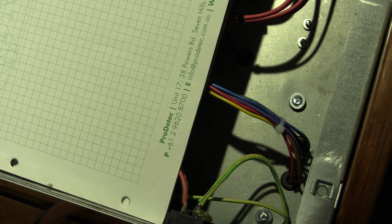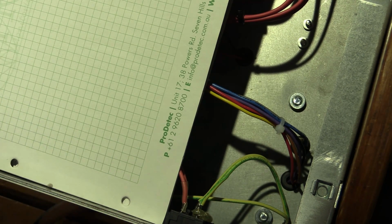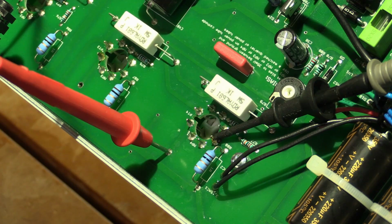And how do I know if I've reached the right voltage? Well, because plate voltages vary from amp to amp. But there's one thing that's a constant, and that's the filament voltage. So we're going to monitor the filament voltage, and if when we get to 240 volts on my variac we're seeing 6.3 filament, we know we got our wiring right. I'll be measuring the heater voltage, which is between pins 2 and 7.